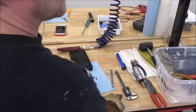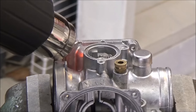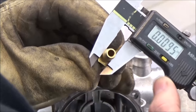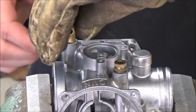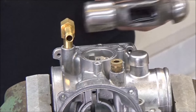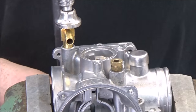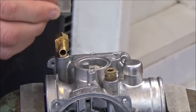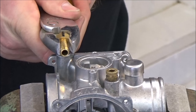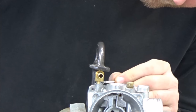I'm going to go ahead and heat the body of this carb up. I've got my caliper already ready to go. Remember, I don't have any rubber parts in the carb whatsoever. After squaring it up, you'll see we use a C-clamp and go ahead and start to press it down in there. You're going to see me stop and measure multiple times — measure twice, cut once. I was dressing it with a file to create a flatter edge because the clamp kept wanting to slip around. Then I reversed the clamp direction and it seemed to flex less. I also put some epoxy in there — you probably don't have to with that tight of an interference fit, but it's cheap insurance.